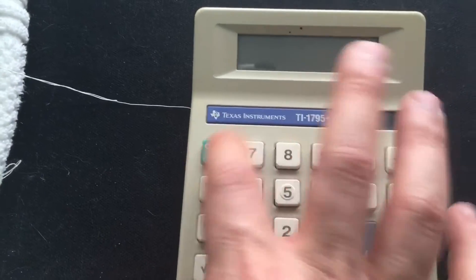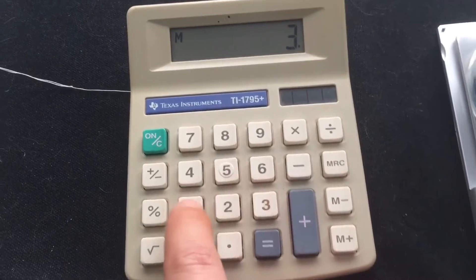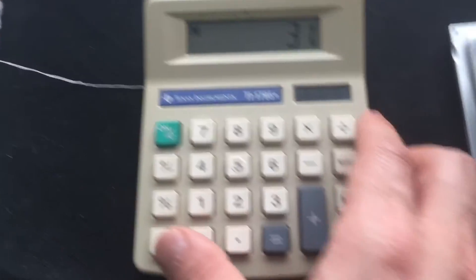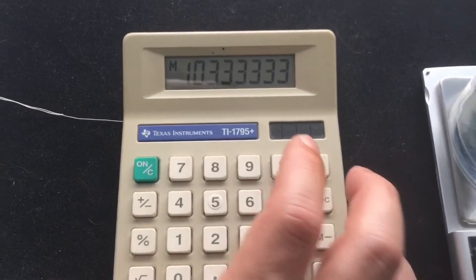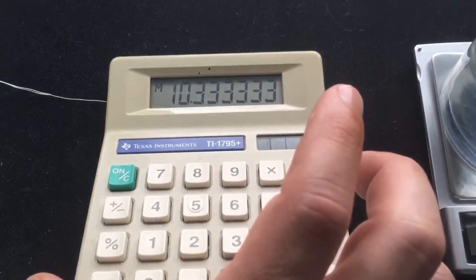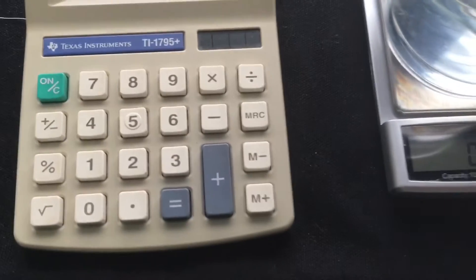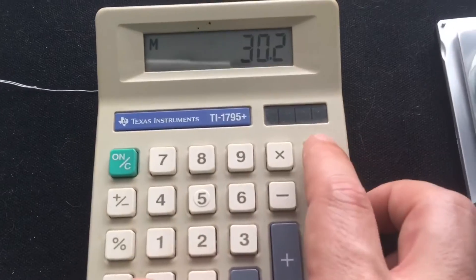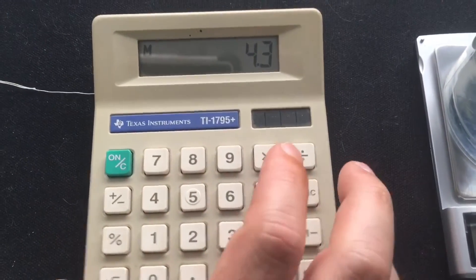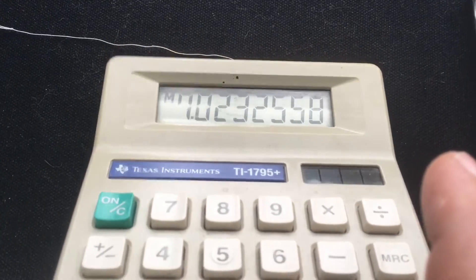Let's get the calculator and do the math. For the real panda: take the original dry weight which was 31 grams, divided by what it weighed in the water which was 3, and we get 10.333. That's the number we want — pretty close to the known specific gravity of silver. Now the fake one: 30.2 divided by 4.3, which was what it weighed in the water.